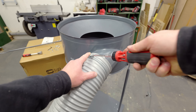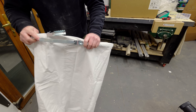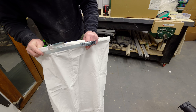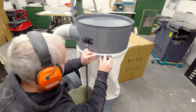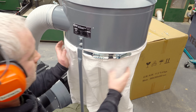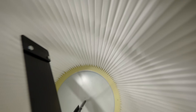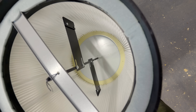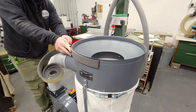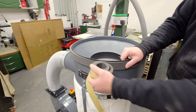My mission is to set things up so that I won't have to fit plastic bags again in future. However, it's worth pointing out that the fabric bag provided with this extractor has a seam at the top to accommodate the sprung strap clamp, which actually makes it much quicker and easier to fit compared with those wretched plastic bags. Now looking at the cartridge filter - the pleats at the top are held in place by some kind of resin so that they don't distort, a nice touch. And there are two rubber flaps for cleaning the pleats, activated by a handle on top.